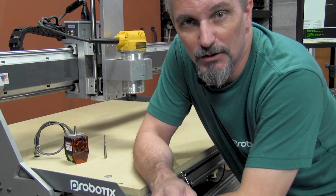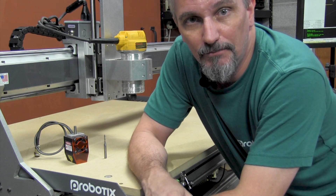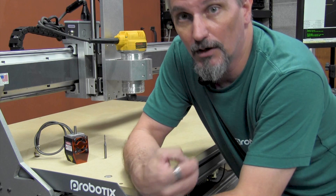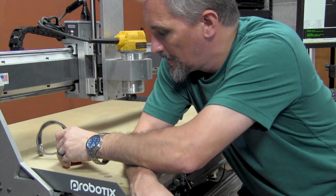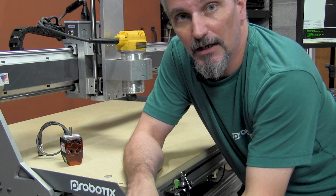This project is done in two steps. The first step is to cut the grid. The second step will cut pockets for threaded inserts like this. For the grid you can use a fine pointed engraving bit such as the 30 degree bit found in our starter tool set, but for this video we're going to burn the grid with our new spindle mounted laser attachment. And then the second step is to cut the counter bore holes using an eighth inch fishtail end mill, which is also found in our starter tool set.